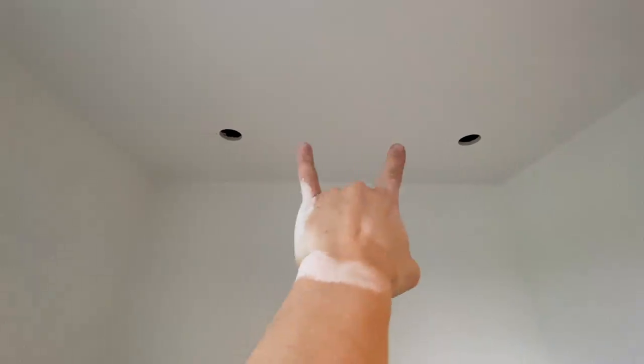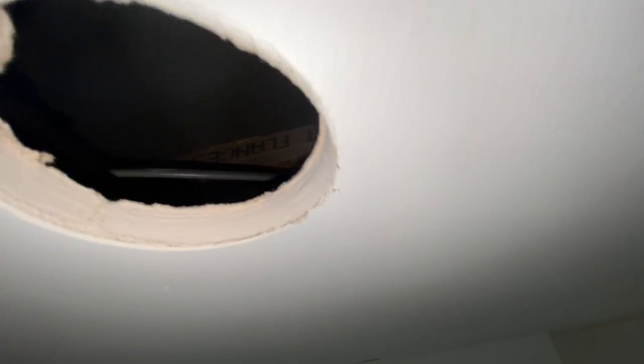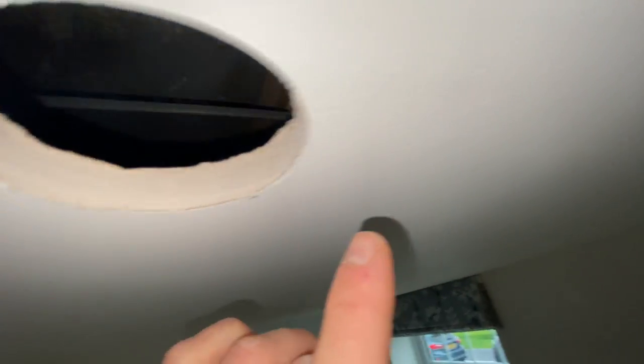There are our holes. As I said, I've got a timber here - we're going to have one there and one there. Hopefully we can drill and find a pre-knockout in there. I can feel something - there's some cable there. That's power - power upstairs sockets. That's probably the bedroom above here isn't it? We've got power clipped to there so we're going to have to get through that one. I'm only seven and a half - that's gas James, that's even worse. If you can see above there is a cable, so we've got a hole drilled already. We'll probably get the ferret cam in and be able to get across there with that.